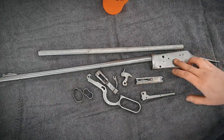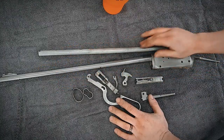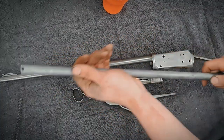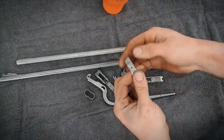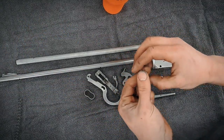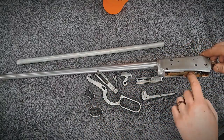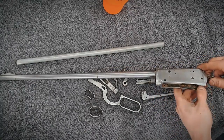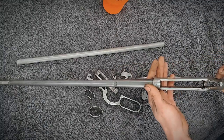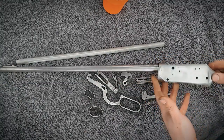I'm a bit skeptical about sanding this, but I'm going to try to get everything uniform. I don't know what alloys Winchester used at the time, but we're going to find out. Make sure you really rinse all of these pieces well, otherwise they'll start flash rusting on you. The bottom of this receiver is already flash rusting, so I'm going to go over it with some steel wool inside the receiver just to keep it from getting worse — but that's fine, no big deal.